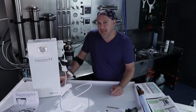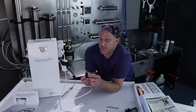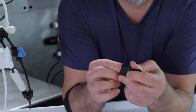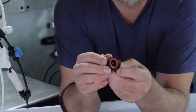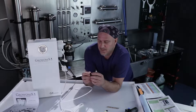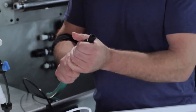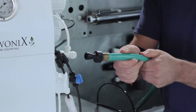Now we're going to plumb up the feed water to the input of this unit. In the kit we give you a garden hose adapter, which allows you to hook it up to a garden hose in a pinch. We're not big fans of garden hose fittings for long-term installations because they don't seal on the threads like NPT fittings — they have garden hose compression washers, which isn't great for long term. But if you're in a pinch or in a greenhouse, you're welcome to use it. To use a garden hose adapter, simply thread the adapter onto the male end of a garden hose and take a piece of the 3/8" tubing and hook it up to the 3/8" fitting at the input of the unit.